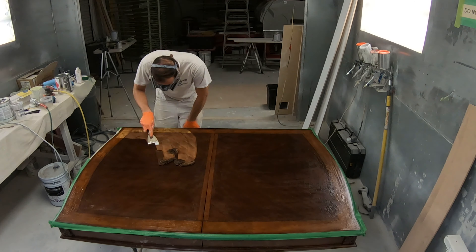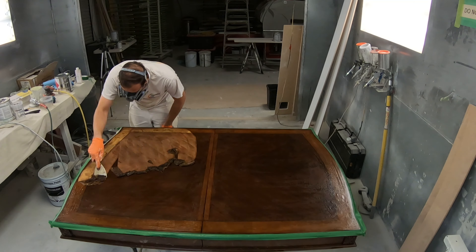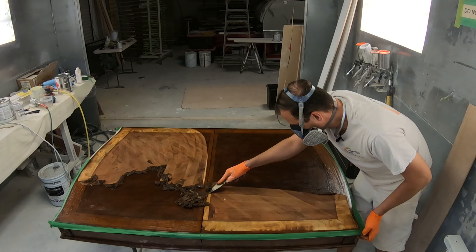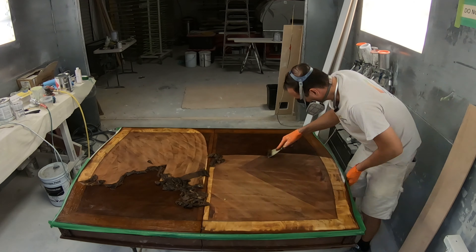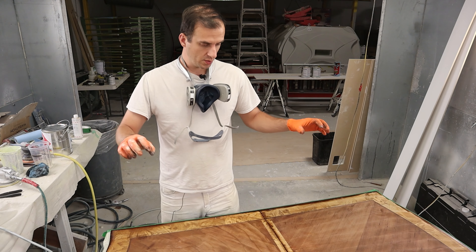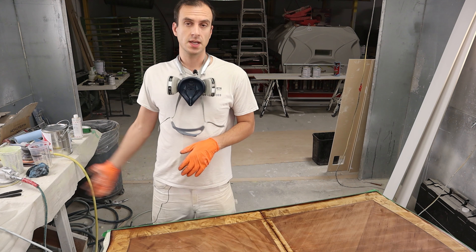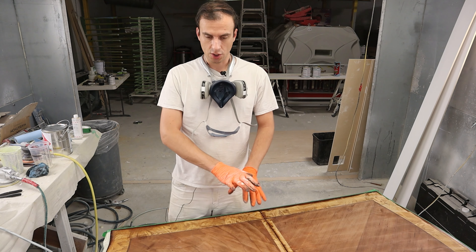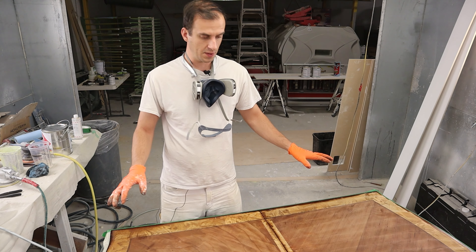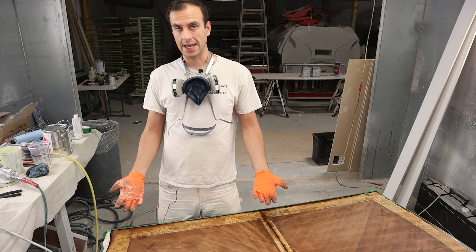But you don't want to keep it too thick, and now I'm trying to get rid of it all. As I go, I try not to push on either side of the putty knife, just so I don't scrape the wood — I try to slide it along the surface nice and smooth. Now when I get rid of the majority of the finish, I can get my sander out and get rid of the rest of it, make sure it's smooth.